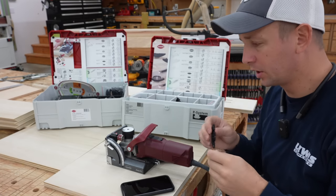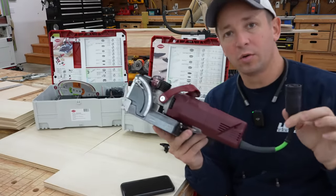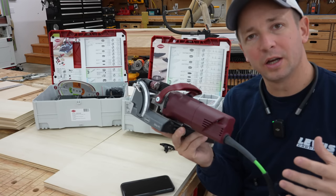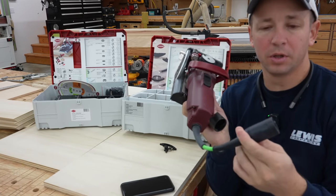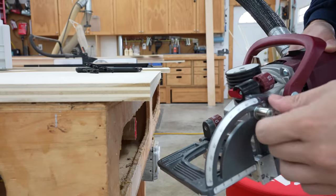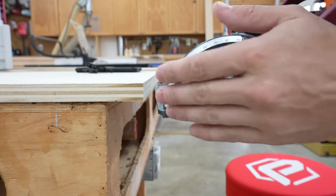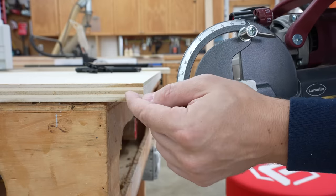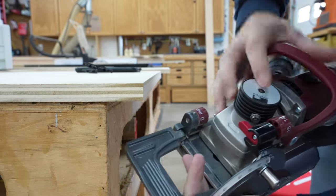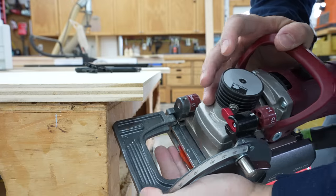Right now I want to give you a close-up and show you what this looks like when it's actually mortising and give you the end view as I make a couple of plunges. You will notice this is not the stock cord that comes with this tool - it comes with a cord probably 10 feet long or so. I put a Festool plug-it connector on the end of it because I'll pretty much always be using this with a vacuum hose. I'll go ahead and plot my fence down here, lock it in place. I want you to pay attention as I make a mortise - once I get to the very end of the plunge, you'll be able to see this blade actually oscillate and pivot and create that unique groove. That happens whenever this little bumper here hits this red bumper, and that is what makes the tool engage that oscillating function.